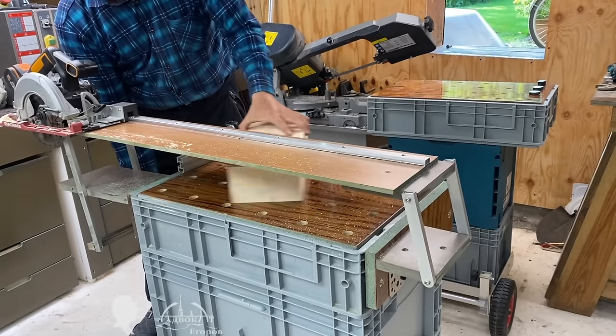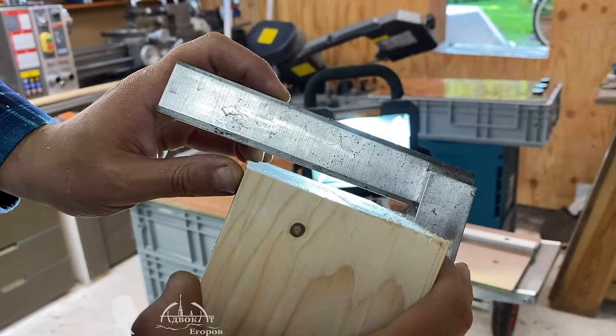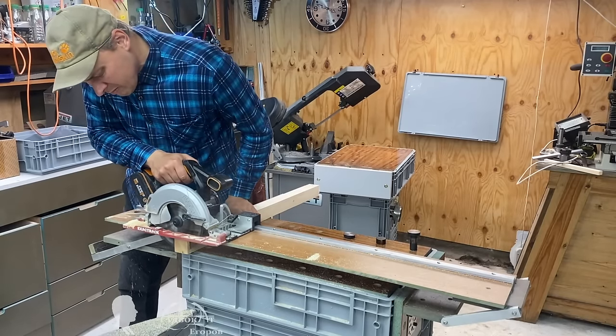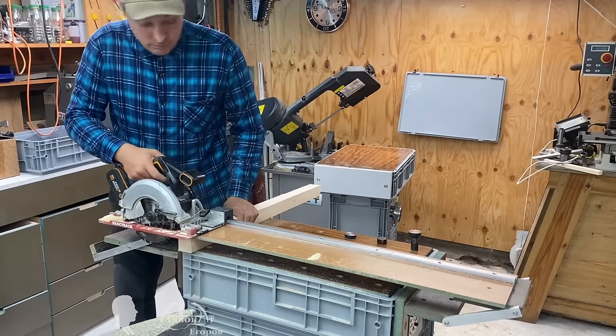When making an end cut with a flip, the square shows perfect 90 degrees, and the cut surface feels smooth to the touch. However, the flaws are visible in the clearance, which I can live with for now. Later, I can fine-tune the preset 90-degree angle on the saw.